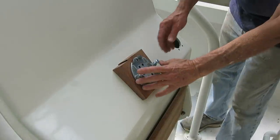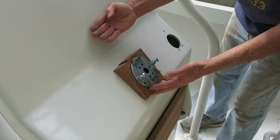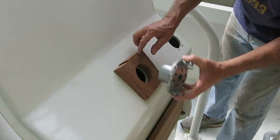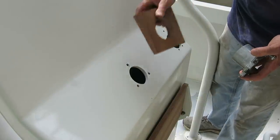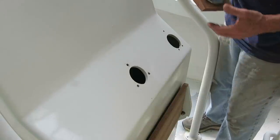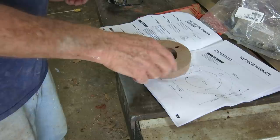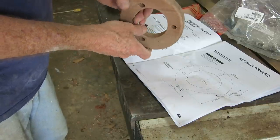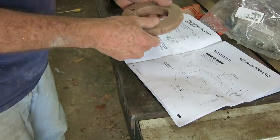A little bit frustrating, but to fit this block I had to take everything back apart. With the block in place, the combination of pulling it out this way and leaning it a little will keep the steering wheel from hitting. I need to make the block round, sand it pretty, epoxy it, and paint it. I could leave it natural but it's almost impossible to varnish between white and varnish with shaky hands, so I'll paint it. I drilled the holes, cut the outside with the bandsaw, rounded the corner with the router, gave it a rough sanding, and I'll seal it with epoxy overnight.